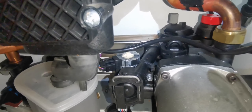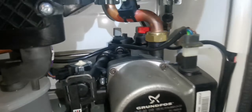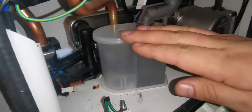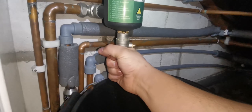Some of these would have a motor there - one of the old school looking motors - and the diverter would be there as well. On this one I believe the diverter is on this side, which you can see the motor there. What we need to do is get to the back there and take that plate heat exchanger out. Hopefully it's not too difficult to do. I just need to move this out of the way to get to that screw there, which is fair enough. Seems easy enough. Then I just need to undo that one there, and from what it looks like that's all I need to do.